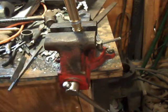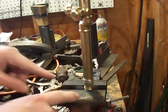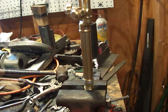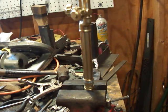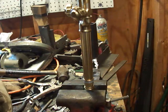Now for the fun part. I'm going to try and heat this up right here to melt the solder that I think is in there. I know the old Victor 100C bodies — the real old ones — are soldered together, so I'm assuming this Victor clone is also soldered together, but we will find out. If it's not soldered together I'm probably going to toast this thing, but we'll give it a shot and see what happens. I've got the camera at a little bit of an angle so hopefully I can get in here without messing it up.